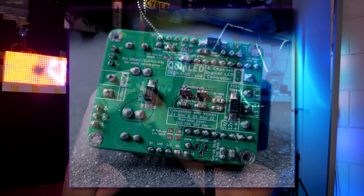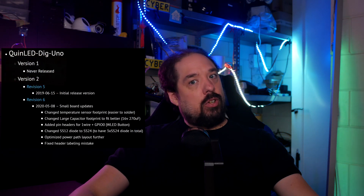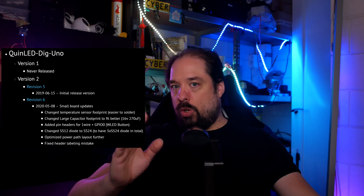Quickly about the board — it's still the same QuinLED Dig Uno you've come to know and that many people love. I've updated it slightly, so the board being sold is based on the new version 2 release 6. I've released those designs for the DIY version also, and everything is already live on my quinled.info website. So whether you want to buy pre-assembled — which has SMD level shifters and some other components — or want to build yourself, both are good options. Building yourself is still absolutely the cheapest way to do it. Main improvements in version 2 release 6 are adding some GPIO pins and changing some footprints. All functionality between the two designs is 100% the same.